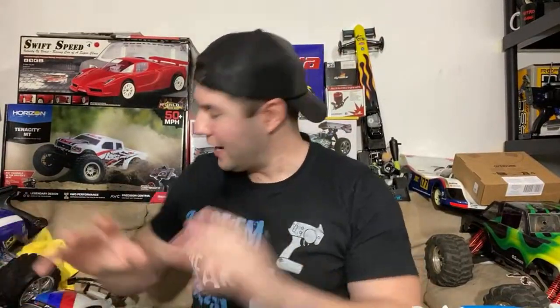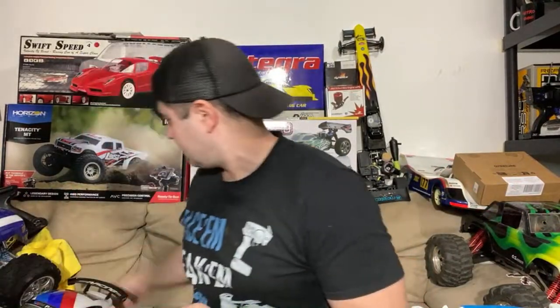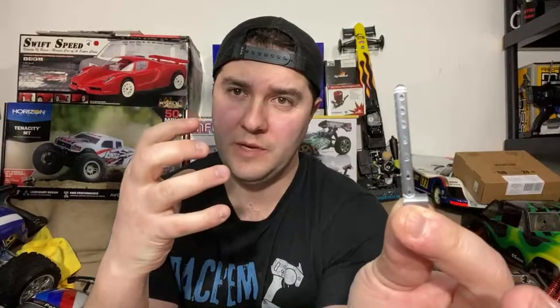The regular cheap filaments are basically for models. PLA — that's for modeling. I printed a body post with PLA — it prints very well at a low temperature, but it's more of an aesthetic part, not really a functional part. I'm experimenting with multiple materials. I also printed one with PETG — polyethylene terephthalate. The PETG is harder to print, it sticks to the bed really poorly, you have to print it at a higher temperature, and it took me like five prints before I even got a passable body post.